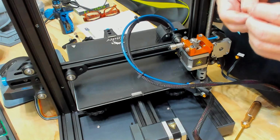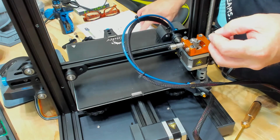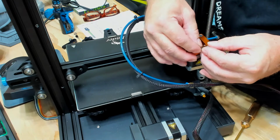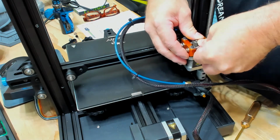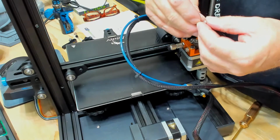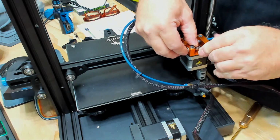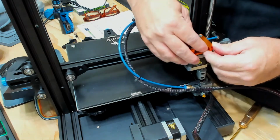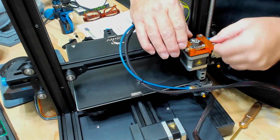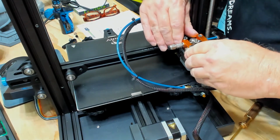Next, we're going to grab our new spring, a little bolt on it. You look at the paperwork to make sure I put that on the right direction. Ouch. And it went flying. That's normal. And you line it up and then run the screw right here to grab it. The paperwork that comes explains exactly how much tension you need. You don't want to get it too tight.